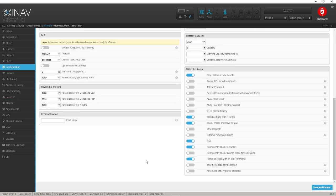To have stabilization in your airplane when you don't have throttle up, you have to enable air mode. I permanently enable air mode so it will keep the airplane stable even if the motor isn't running.